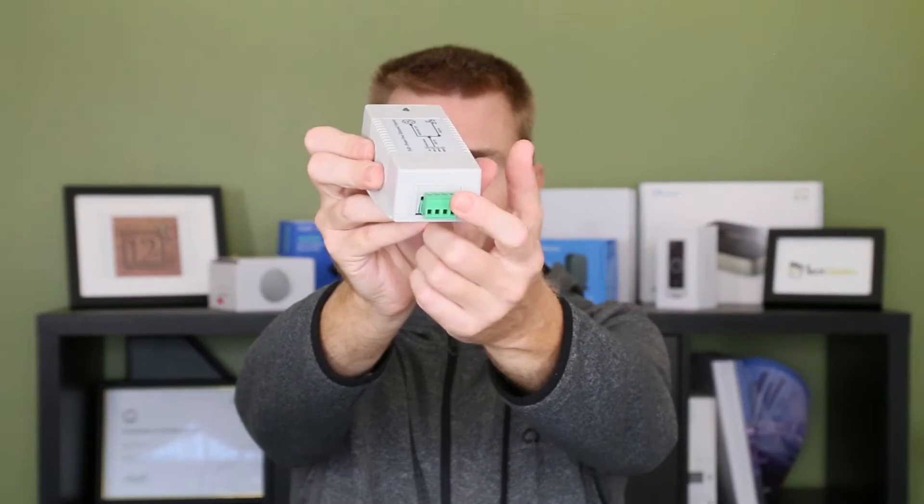This gives us out 48 volts. So obviously maybe you're running a higher output system in DC, then this would be there. If you're going to choose another model, that can take between 9 and 36 volts — so again, if you've got a 12 volt battery array or a 24 volt battery array, you can use this terminal block in.